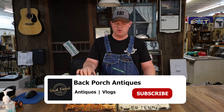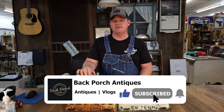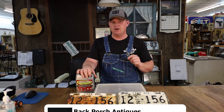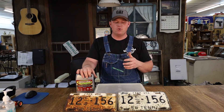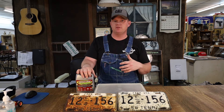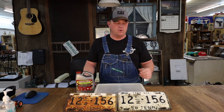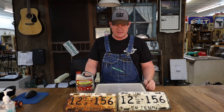One thing I'd suggest is that after you submerge the item and take it out after the allotted time — overnight is a good number — rinse it off. Understand that once metal is bare from the EvapoRust and you've cleaned off all the rust, if you don't coat it with something, rust will come back to bare metal. So what I do is use a shop cloth with WD-40, which will grease it up and prevent it from re-rusting.